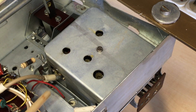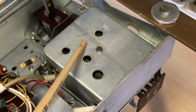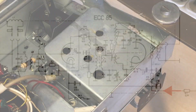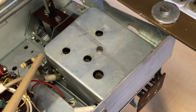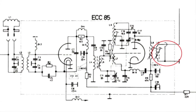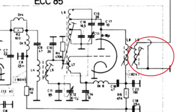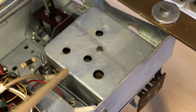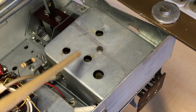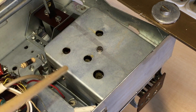Now, there are various points that we can access from here, and some of them you can see right here. We have the chassis ground — a lot of that front-end circuit actually connects to ground. We have the B-plus input point, and we've got the two connectors coming out here, which is really the signal output from one of the IF transformer coils inside. We also have all the pins that are on the tube, and the pins can act as a very good reference point and connection point to do continuity checking. So that's what we're going to do now.